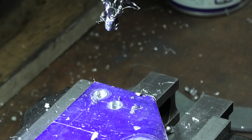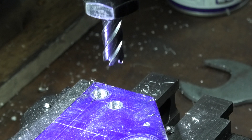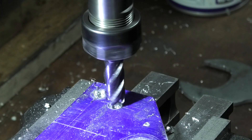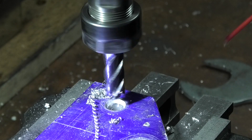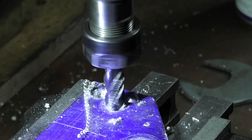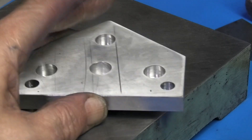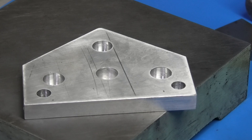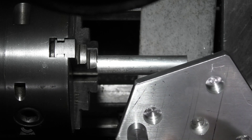I've changed the tool for a 12 millimetre end mill and reset the depth. We can go down eight and a half mill. Now this larger end mill doesn't cut flat across the whole face — that's why I used the smaller one to start. Repeat that for all the holes that hold the magnets. That's the aluminium finished. On this side I have two holes for the sine bar locations and four holes for magnets. The next job is on the lathe — to turn the aluminium bosses which will go in these holes and hold the magnets in position.